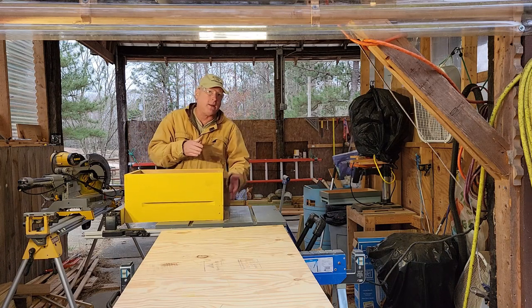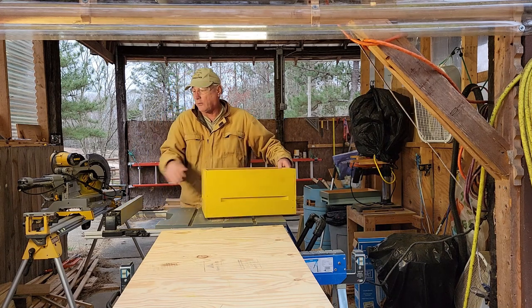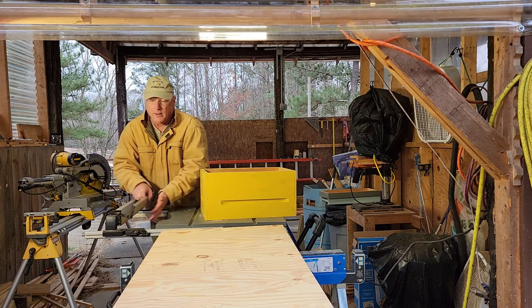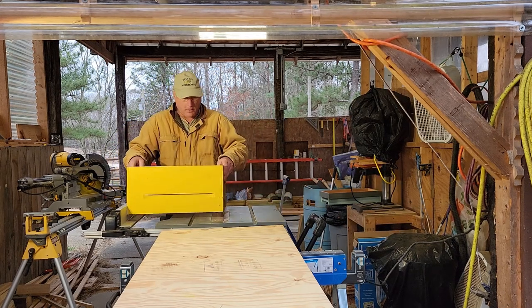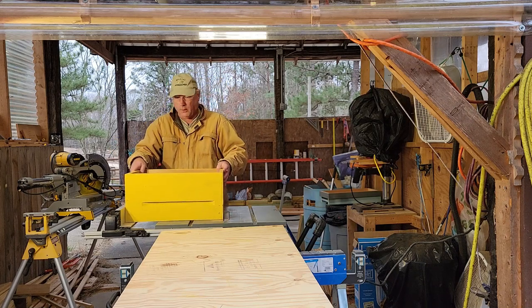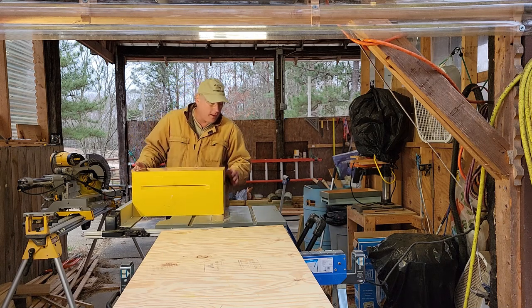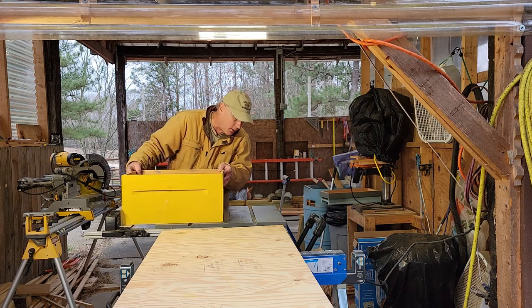Again, it should just lightly touch the blade and not spin it. One thing about this DeWalt saw, if you get too far over and you get too much of a gap, it does have this little fence where I can actually rest it on that as well, so it doesn't move. That could have been also what was going on. Again, I'm not a carpenter by trade, but you can see how easy it runs smoothly up against it. All right, everything's running fine.